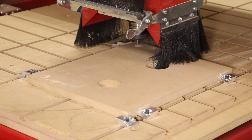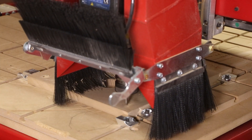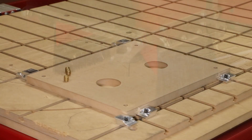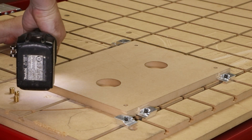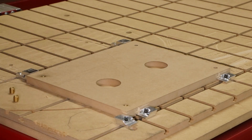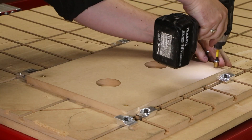We're using two cutters to produce this fixture plate: a surfacing cutter to quickly pocket out the reliefs for the threading process to take place, and a quarter-inch cutter to pocket out the brass insert holes. Here we can create the relief pocket in the exact positions we need and strategically place brass inserts so that we can mount the actual threaded nut blank to the top of this fixture plate.